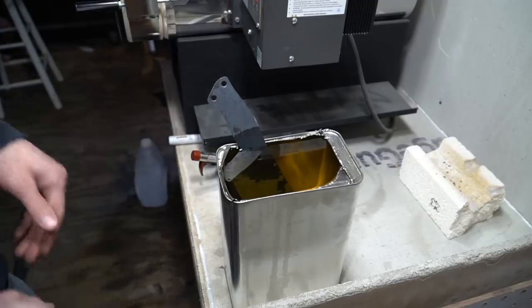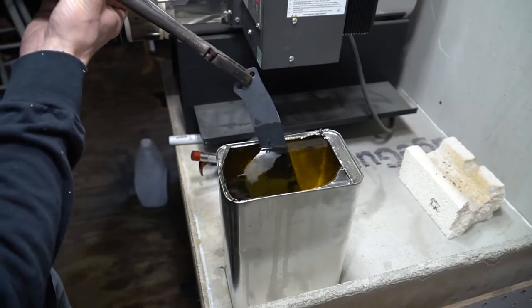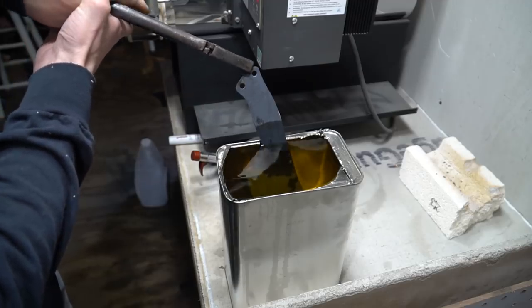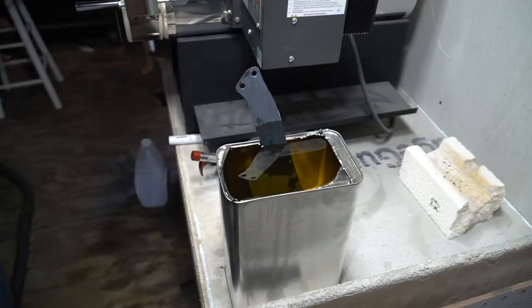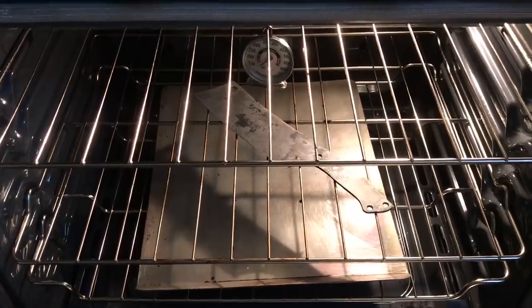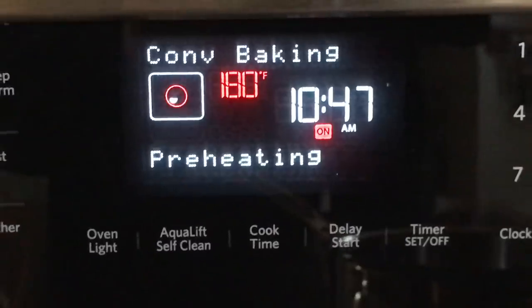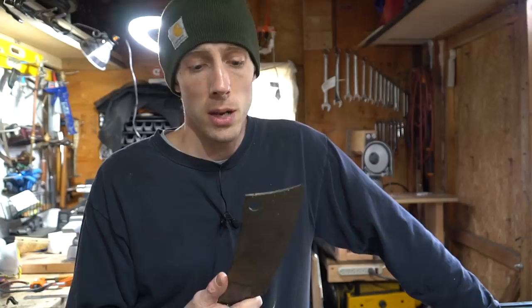The idea is to not let this cool off below about 120 degrees. We'll throw it in the oven and then get back to grinding. There's our blade — two cycles at 400 degrees for two hours each. Change of plans though: I did two one-hour cycles, because in a post-apocalyptic world, who's got time for two two-hour cycles? Kind of nervous — time to grind.